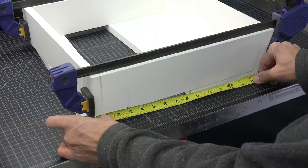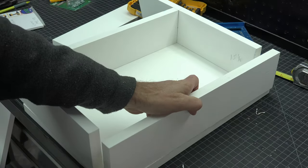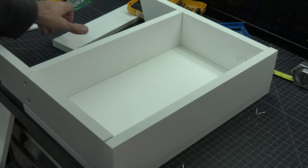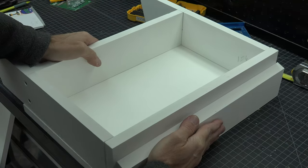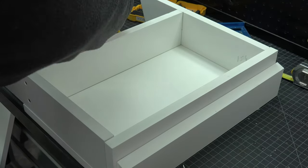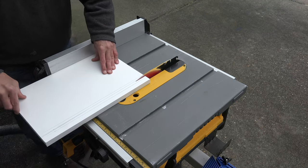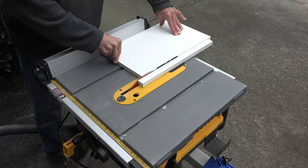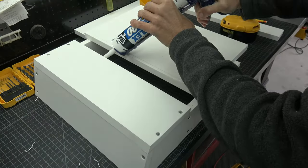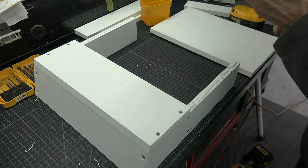With that piece in place, I take my measurement from the end to the piece I just cut for my next rip. I take another piece and place the box back together. I'm going to cut the lid now, but I want to make sure it goes all the way across to sit halfway on the cross support. With the box upside down, I make a mark on both sides of the cross support to ensure I am cutting it in the dead middle. This piece was actually a scrap piece and was twelve inches wide, so keep that in mind when getting your material. With the base cut to size, you can screw it together.